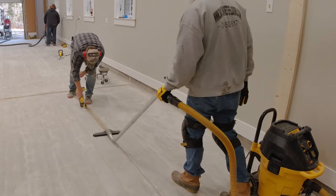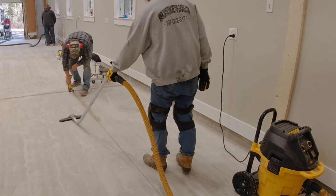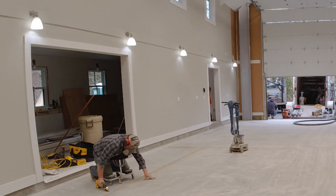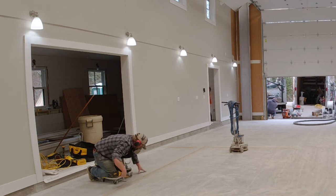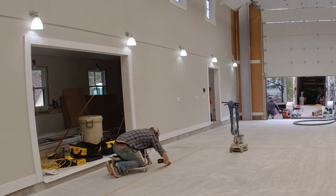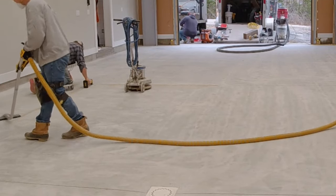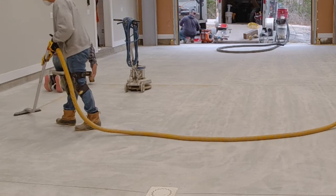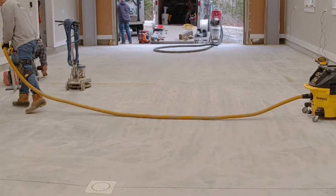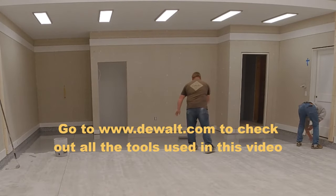When you're doing epoxy coatings on a garage, clean joints are really really important — you don't want to get any dust up into the coating. It literally just takes a couple minutes to go through all the joints and get them cleaned up. The method for doing this is always grind to prep first, and having the right tools helps make that faster and easier. The DeWalt tools made this really easy — I'll have a link for the tools down in the description below.